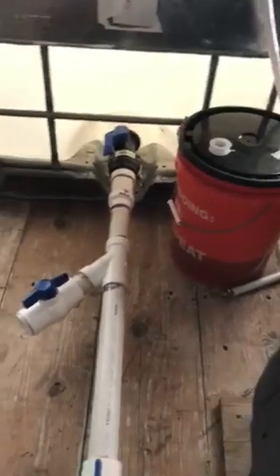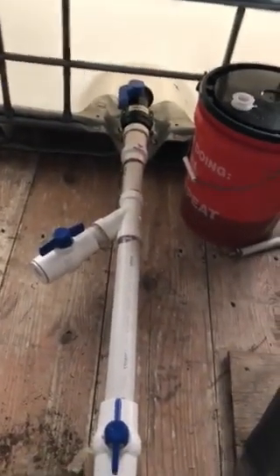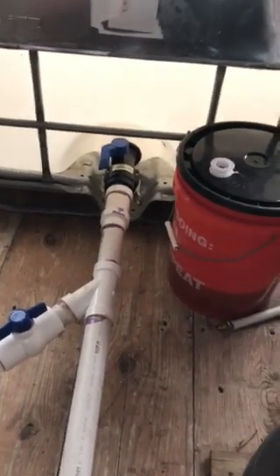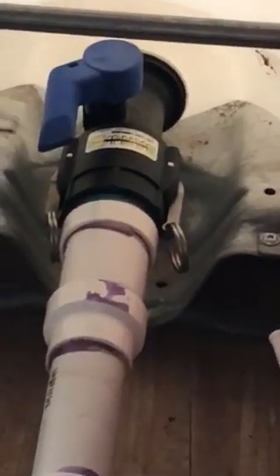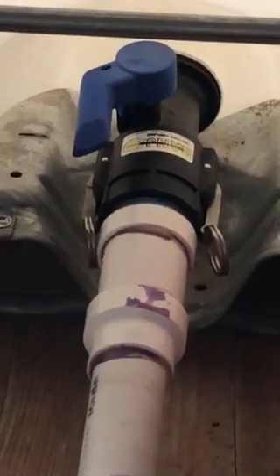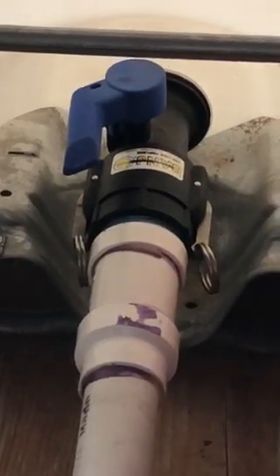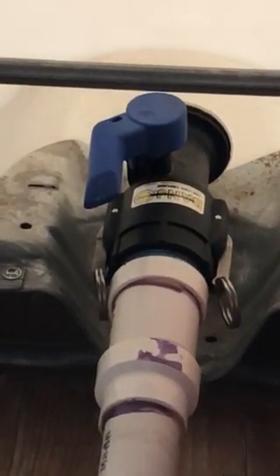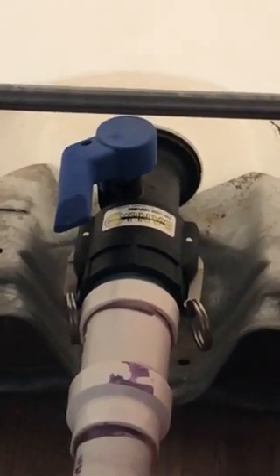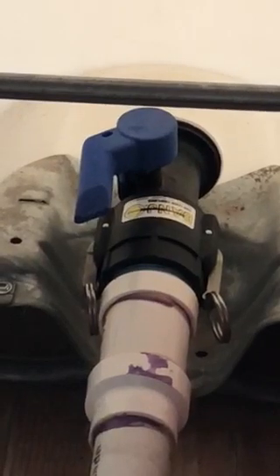What's going on, it's Blake here from Efficient Washing Solutions LLC. I just wanted to give you guys a quick update on how I plumbed out of my buffer tank. As I mentioned before in a different video, I had a banjo coupling, and basically what it does is it sucks onto the existing ball valve on the bottom of the IBC tote and then it runs into a two-inch female fitting.